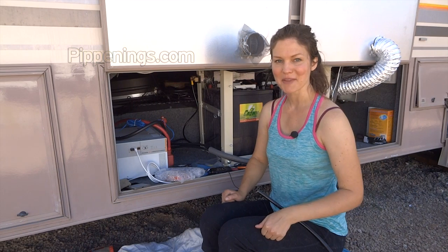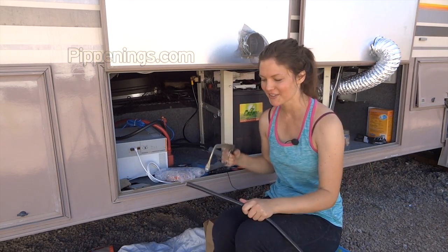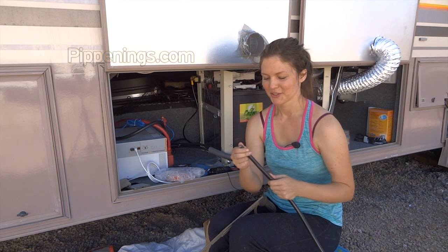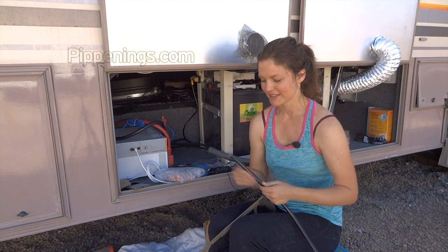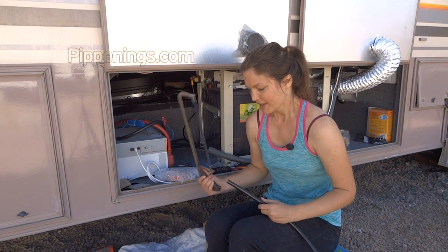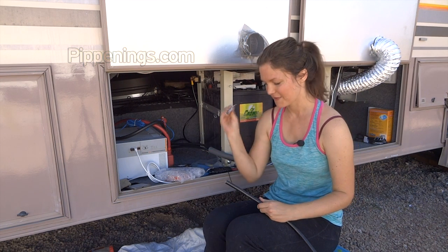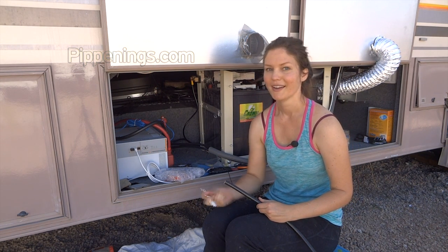It's going to be quite a day building cables because it's all by hand. I'm using a hacksaw. You can't use a chop saw on this because it burns the copper, and then you have to either cut off the burnt part or sand it away, because you want no extra resistance introduced. And then I'm using my hammer pounder to connect these feet, and it's just one step at a time. So let's get started.